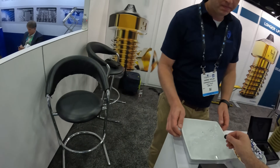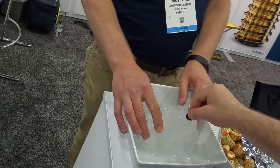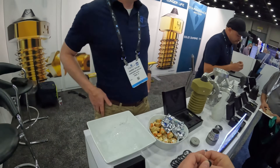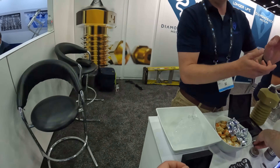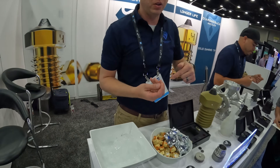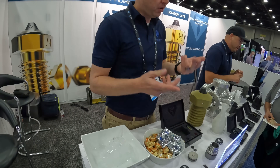There's a solid piece of diamond — you just feel that instant heat transfer. What does that mean for the nozzle? The tip is always going to be the temperature of your heat block, because as the filament extrudes and pulls that energy out, the diamond will just replenish it quickly. That reduces clogging and gives you better consistency throughout your print.